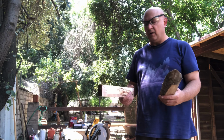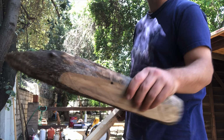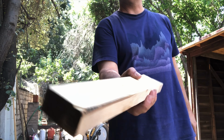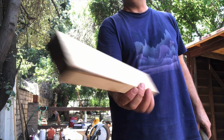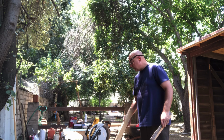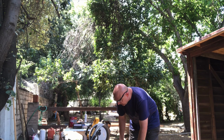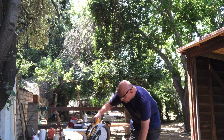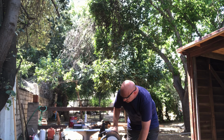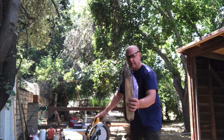So now, from point to point, obviously this needs to be the sharp end because of its inherent shape, the way it came out. This piece is closer to a 2x4, and I'm going to judge how I'm going to cut it differently. So I put a little angle on my chop saw, vised it down, and I'm just going to kind of eye it like this and make sure it's really sitting up against the fence. And voila, I've created a straight edge on one side.